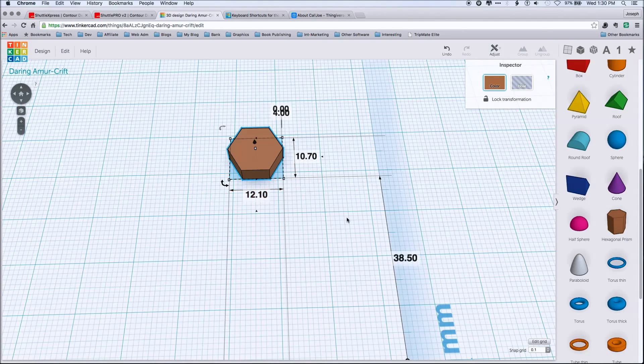I have also found in measuring them that this wider perspective is usually not in a perfect ratio to the narrower one. In other words, heads and nuts are not perfect — there's a bit of tolerance. A good rule of thumb I've found is at least one millimeter difference. This particular bolt happens to be a little bit more; instead of 11.7, this is 12.1, as measured with calipers. But if I were to go to 11.7, you see that kind of squares it up a little bit more.